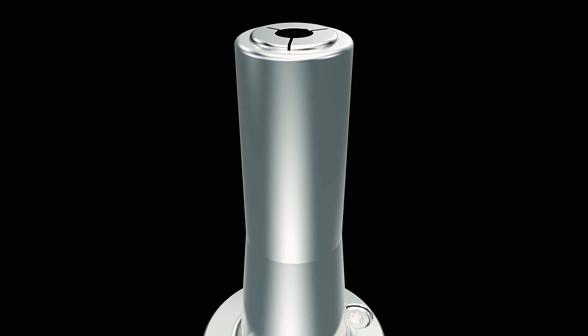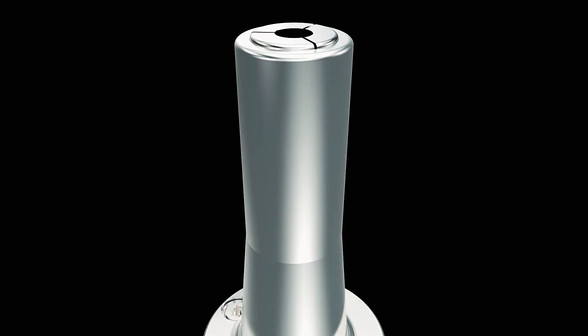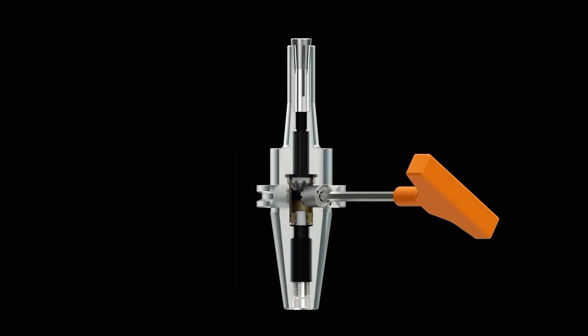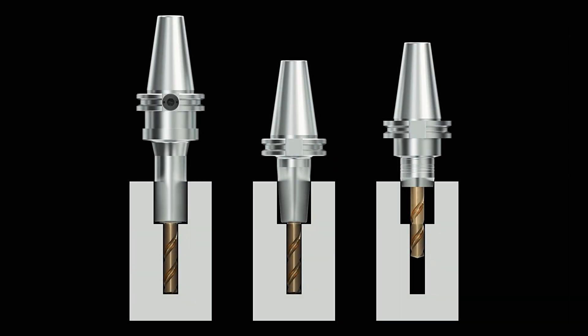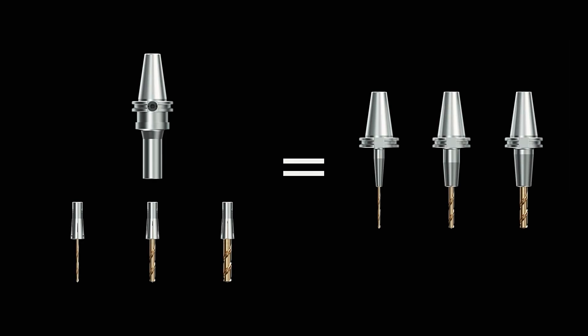Next, let's look at the nose of the MMC. As you can see, there is no nut to hold the collet in. Because the drawing mechanism is used instead of a traditional nut, the MMC system has great precision and clearance. When compared to other chucks that do not use a nut, the body of the MMC is slimmer than a hydraulic chuck and has more versatility compared to a shrink fit chuck.